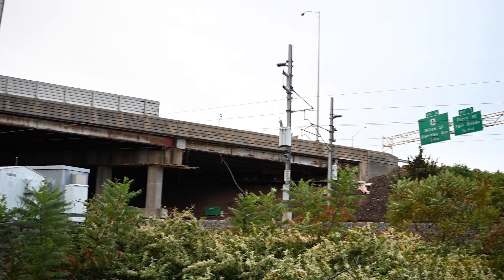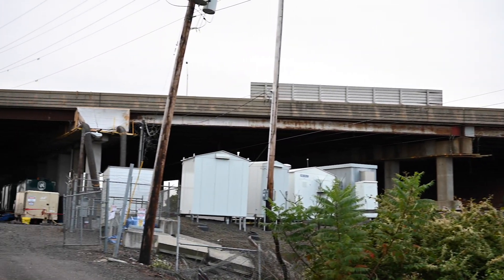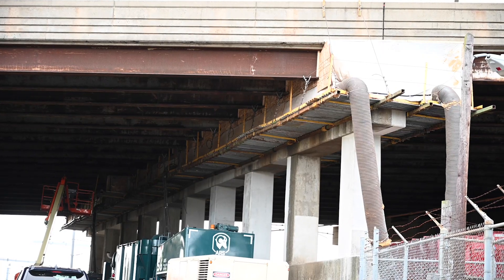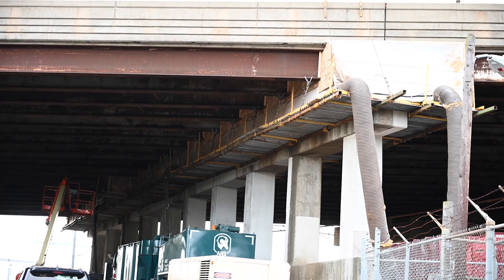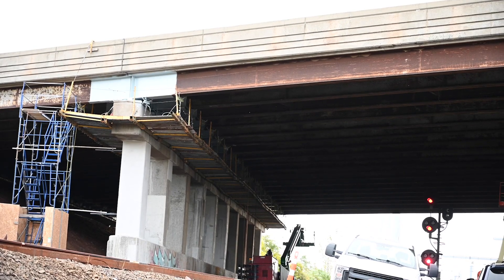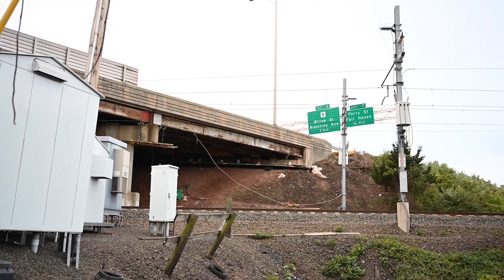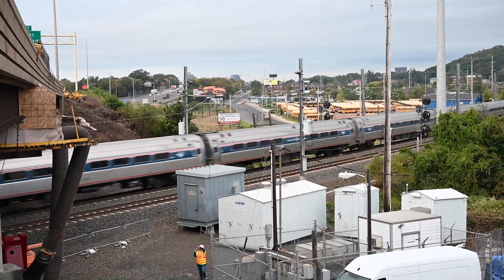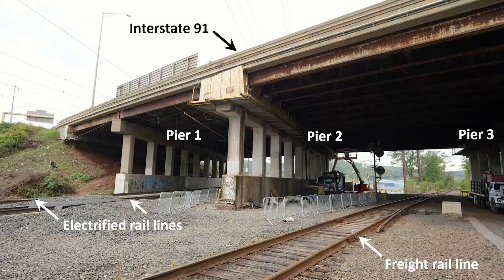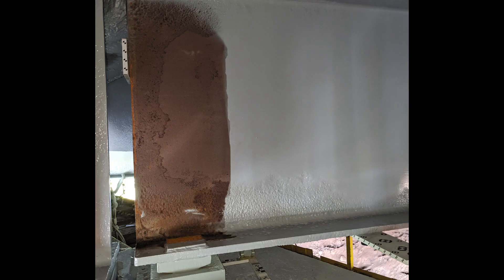Today I'm mainly focused on our field implementation process and results. First, an overview of the bridge. This repair was selected because traditional repairs were just not well suited. It was a challenging bridge — over Amtrak, with both freight rail and electrified rail lines severely limiting access. The bridge was also skewed, adding complexity, and there were variable beam sizes. We had different skews at each pier, different bearing designs, some locations with bearing stiffeners and some without — which added complexity to the individual designs.